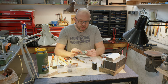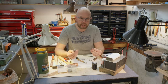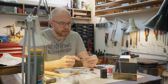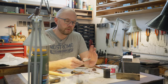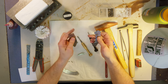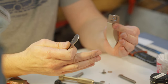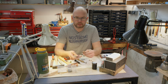I've developed this special system for fitting my locks that requires a lot of precision work. One of the features is a hardened steel insert incorporated into the frame. It fits very precisely and is held in place by a screw. What it does is give you a much better feel and a much better action for the lock — it holds the knife securely but the disengagement is very smooth. Traditionally you would let titanium rest against steel, but titanium likes to stick to steel. Hardened steel against hardened steel is buttery smooth.